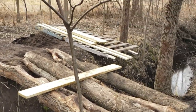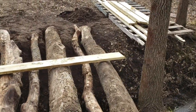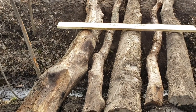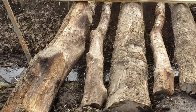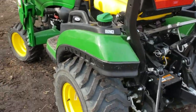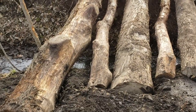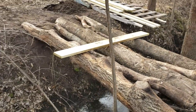We're going to be using dimensional lumber for decking — these are two-by-ten green treated, so they can come in direct contact with the ground. Obviously these logs aren't green treated and they're not going to survive forever, but they're very sturdy — plenty sturdy to lift up our 1025R, which has another 220 pounds of water weight in it, plus the front-end loader, and with the ballast box we're pushing around 2,600 to 2,700 pounds.